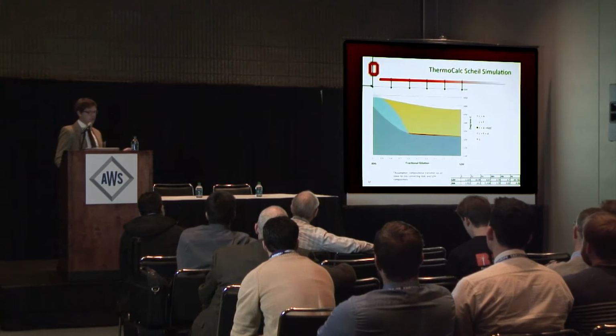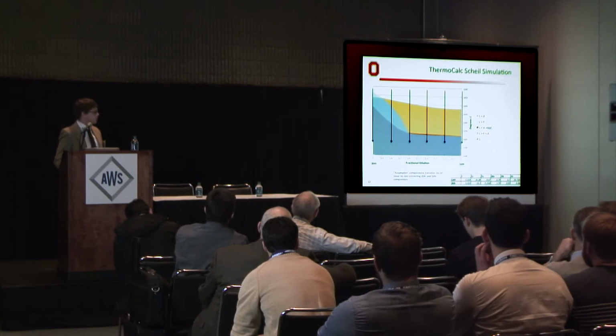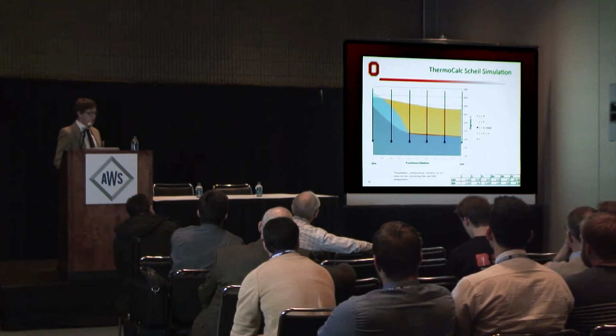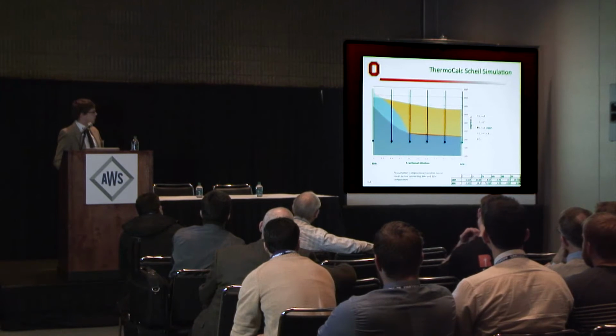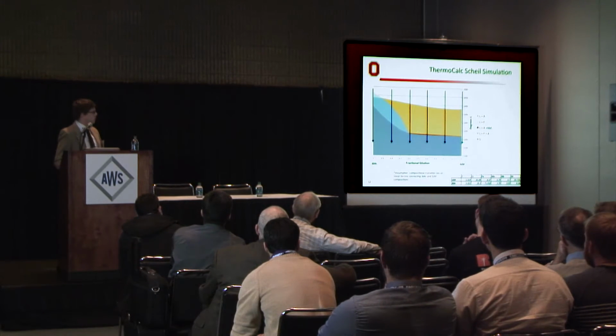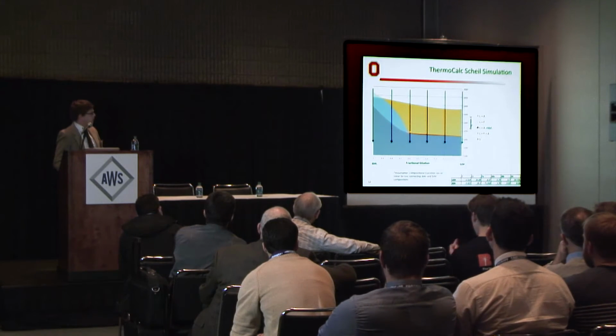So what this actually means is as we're solidifying, as we're growing filler metal off of the base plate, we have a transition zone that's spanning, on the left here, 100% dilution to 0% dilution in a very short amount of time. So it goes through this solidification scheme where blue represents ferritic FA solidification mode, and orange represents A or AF solidification mode. And we have the nickel, chromium, iron eutectic existing in this dashed region. And I've highlighted in red our suspected solidification cracking culprit, niobium carbide matrix eutectic.